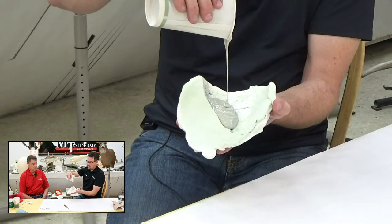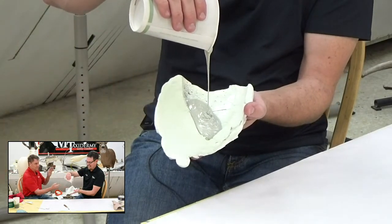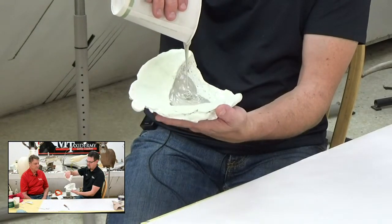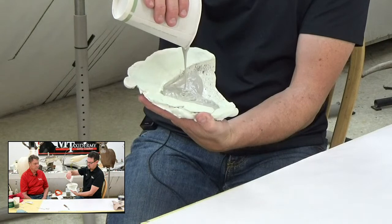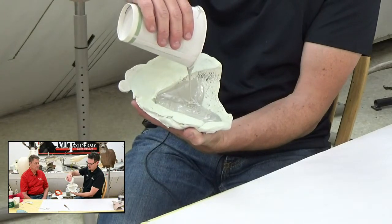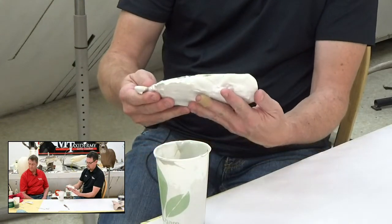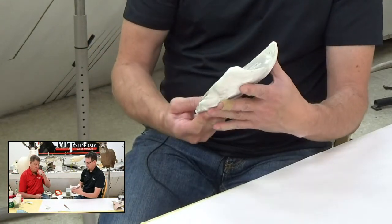And the longer the ribbon is, the skinnier, narrower ribbons, some of the air bubbles in it will tear and pop as the resin comes out of the cup. So that's desirable too. What we want to have ideally is a bubble-free cast. And you can see it's so nice and thin that it's coming in and taking up all of that detail. So it's going to pick up all that really nice scale texture and all of those maxillary bones and the pectoral fin. I'm just going to swirl it around a little bit and let it get all the way up there.